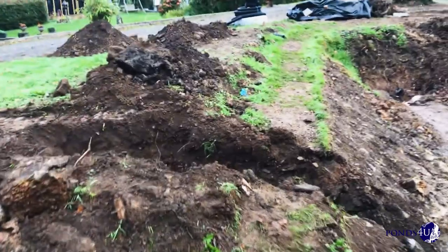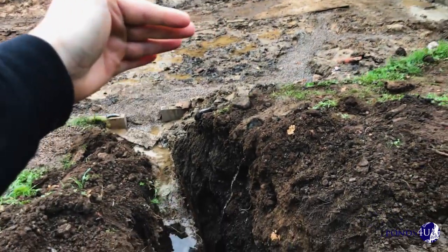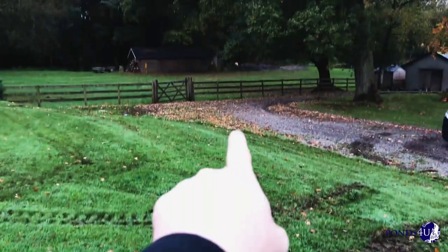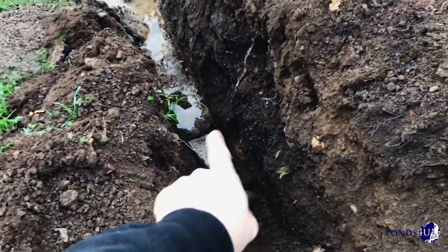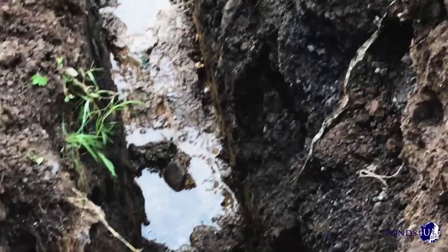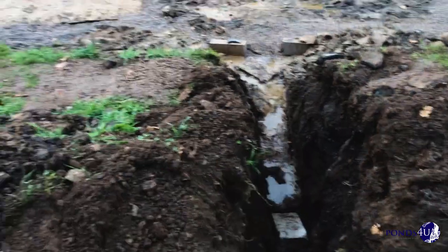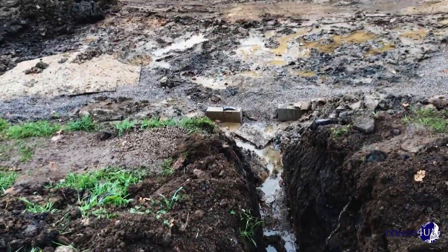At the moment it's just looking a mess. You can see parts of the land drain there. We did set all this bank out and we were hoping to find the land drain further into the pond, but we couldn't find it. So we were actually going to dig our own from here all the way through there, all the way down the drive and into a stream down there, because the customer didn't just want it sticking out with water running down his road. But we were very, very lucky — we found a land drain coming across the ground here. Where it's going we don't know, but it's been flowing since last night and it's still flowing away. It hasn't backed up. I was worried it was going to back up — worried it was just a channel of gravel going 200 metres down and then eventually backing up overnight. But that's been clean, water's running clear, it's running fine. So we'll connect it all up and backfill today.